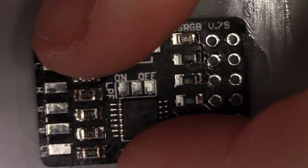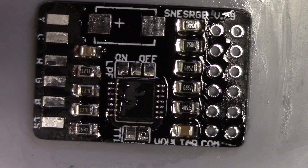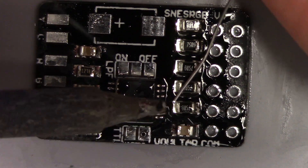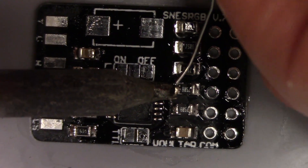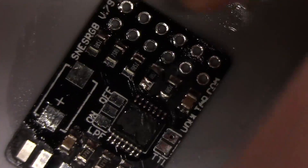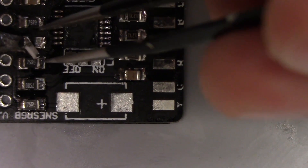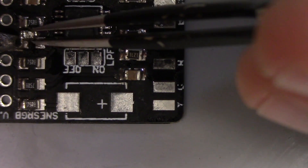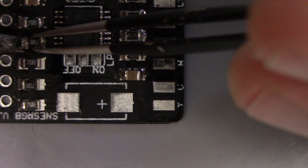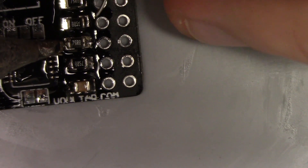If I didn't have a camera here and wasn't fighting all the other obstacles, this would go a lot faster. Here again, it's another passive with no-clean and we're attacking the other side. I had problems because of the angle of the soldering iron — I wasn't making good thermal contact between the iron and the end of those 0805s. You can see I actually have a resistor that tombstones, but this is a good moment because I'll show you how to quickly correct that. The angle of your soldering iron is just as important as where you place it — it's how you place it. I take the component off, reestablish its position in my tweezers, line it up. It looks messy right now but the alignment is good. We'll clean those joints up on both sides. I apply a little more flux because I want to pay a little more attention to these.